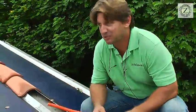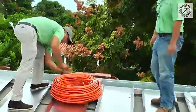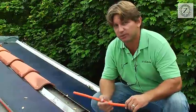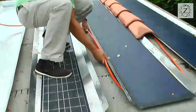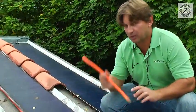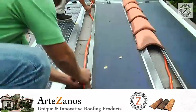For those interested in turning their roof into a hot plate non-glazed collector, you can use PEX tubing. We used a PEX Alpex in this situation, which has a thin aluminum sleeve built in. It's cross-linked polyethylene — it's been used for 30 years in Europe and is starting to be used underneath metal roofs up north. The problem is metal roofs are too expensive for residential. So what we're doing is using the solar pans and collecting the heat energy off them into this PEX tubing, so you'll be able to use the heat from your roof to heat your hot water for domestic use or for the pool.